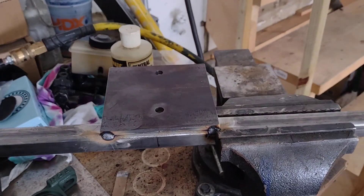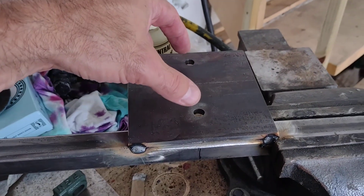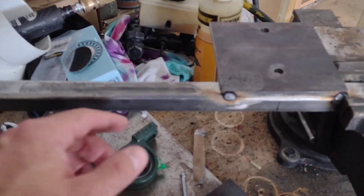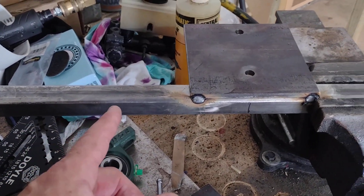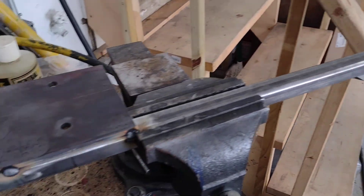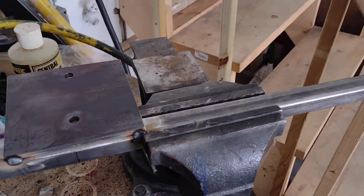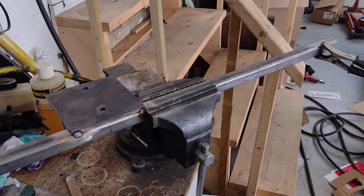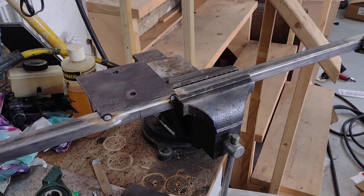The double D three-quarter inch will then go into the drive shaft, which I'll show you how I do that a little bit later. I got two more of those quarter inch plates drilled to match the rack, and this is one inch square tubing with one-eighth inch wall, which we'll use to mount it. So it begins — I should have everything welded up here by tonight.